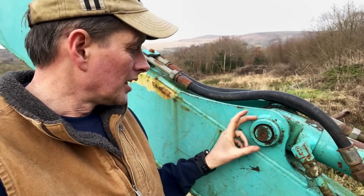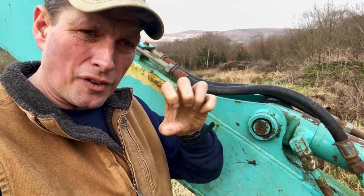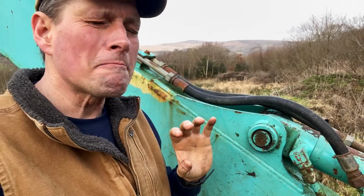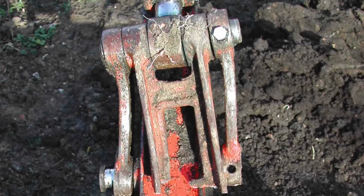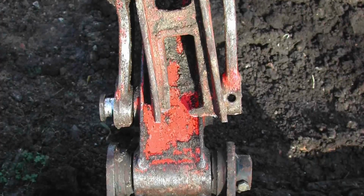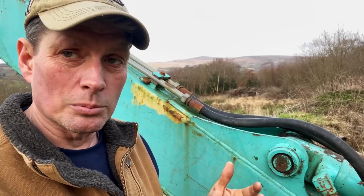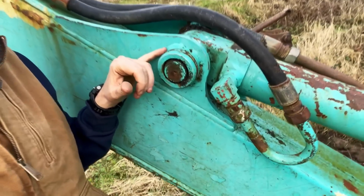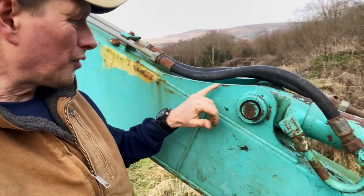The trouble is, because they're a similar hardness, they tend to grab, and then all of a sudden they're fighting, and you cannot imagine the power that a ram is still trying to exert. And rather than that turning nicely, that's when the weakest element will actually part company. It's often these welds. And when that happens, it literally tears this off here.